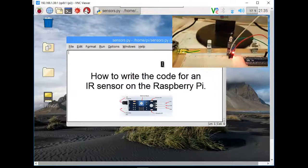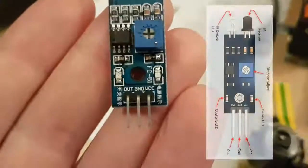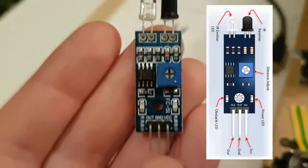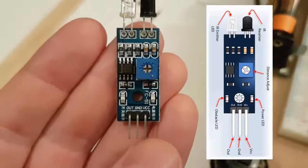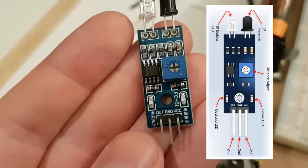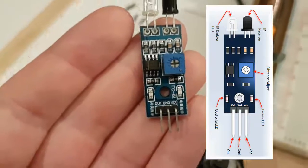We're going to show you how to hook up an infrared sensor to Raspberry Pi and get it working with a little Python program. So we've got three little connectors here: Ground — that's the black ground one, so we're going to put that to ground. VCC must be like a 5V or 3V source. And Out must be for our signal, so that's the switch going on and off. Basically the two on the right are like battery plus or minus, and the Out on the left is the information.